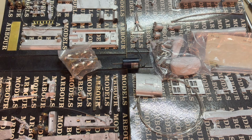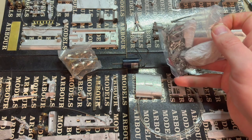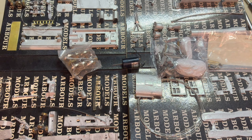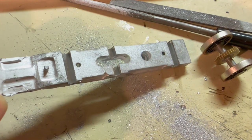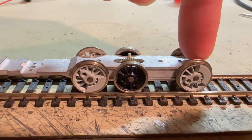Now it's time to get on to the Sierra 460. This one is definitely unstarted aside from a few missing parts — it looks like the original owner of the kit probably tried to assemble the cylinders and crossheads, got frustrated, and maybe even threw the parts out. The current owner has an additional kit on hand just for spare parts, so he sent me some of that stuff — we'll see if it's all there and if not I'll try to recreate what's missing. I'm not going to go into as much detail in this video as I am for the 0-4-0 that's also in progress, but you can at least see a general summary of what I'm doing. Of course, the axle slots are once again undersized for the axle, so I'll have to clean those out.